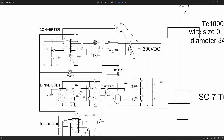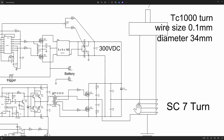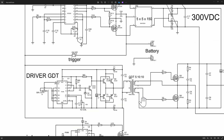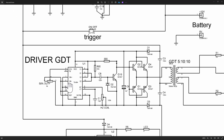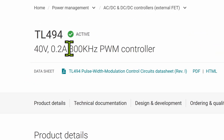But then I want to make a dual resonant solid state Tesla coil. For this to be dual resonant, the primary coil here and this coil here need to resonate at the same frequency, which if you do some back of the envelope calculations, that wouldn't seem to work with these numbers. And the other thing is, someone said the frequency is about one megahertz, but this chip here that would be providing the stimulating frequency doesn't go as high as that, so I can't see how that would work.